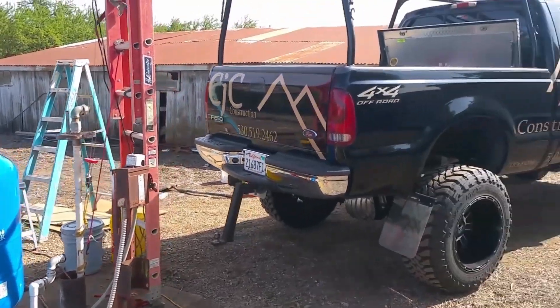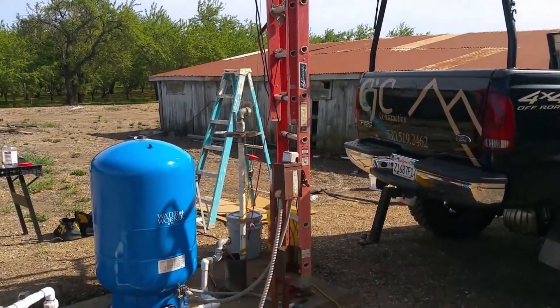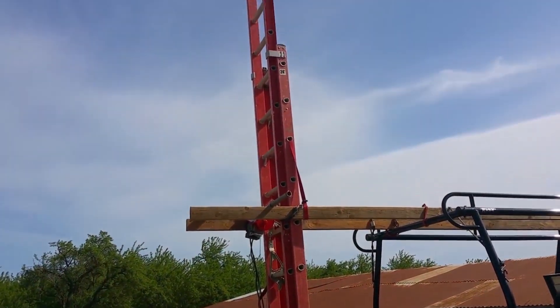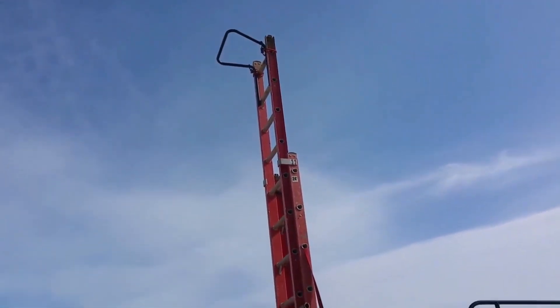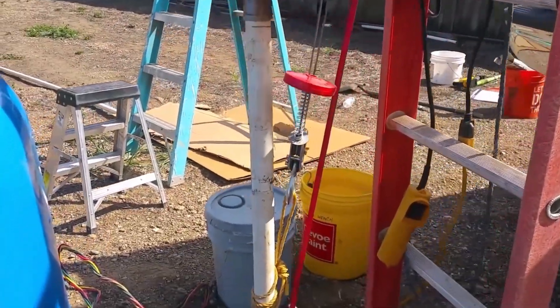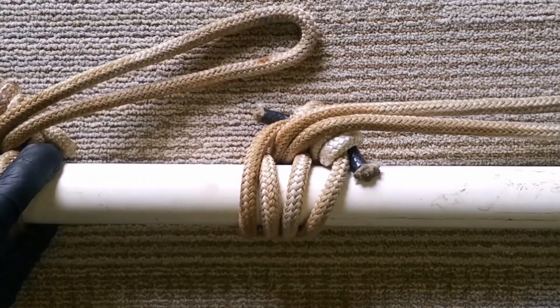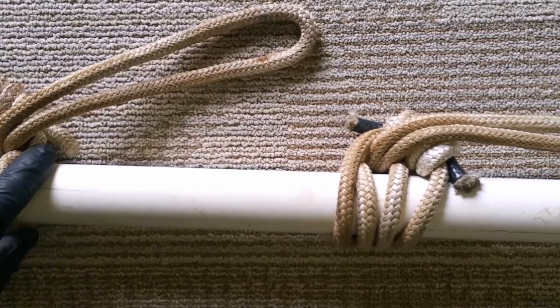Here's what we got: our pickup with a lumber rack, a couple of 16-foot two-by-fours hooked to a Louisville 24-foot ladder. We've got a little getter on the top and a winch right here. This is basically showing not the right way, but a way of pulling a well when you don't have a boom, derrick, and all that fancy stuff. There's another way you can do it and we're going to show you.